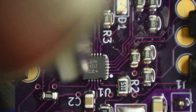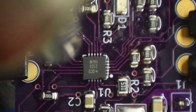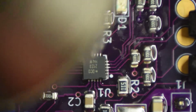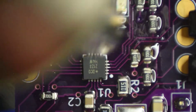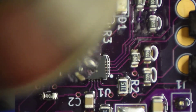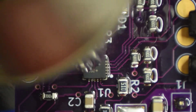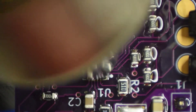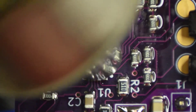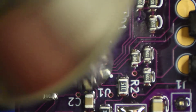Now the hot air. I have the air temperature set for 800 degrees and the air volume at 5%. These are very small parts. Even after the solder at the pads melts, I keep the heat on for a few seconds. I want to make sure the solder melts on the thermal pad, but I don't want to heat it so long that all the flux boils away. Now I'm not trying to hold the chip in place or push down on it — that was causing alignment problems.